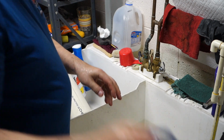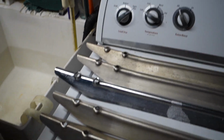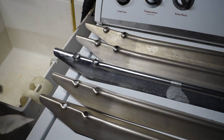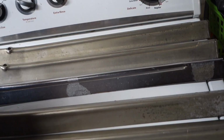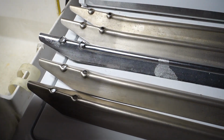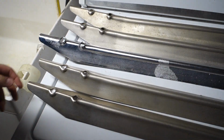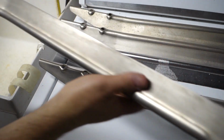There, that's it. These legs I'll put over to the side and we'll let them dry out. But they turned out good. You've seen how they were in the beginning. When they're so rusted like that, there isn't much saving you can do. But they turned out decent. They're clean now. So now they can be, like I said, just do a light sanding on it, throw some etching primer on them, and paint them. That's what these are good for now. And the ones that turned out decent, like this one, that one will be your front leg.